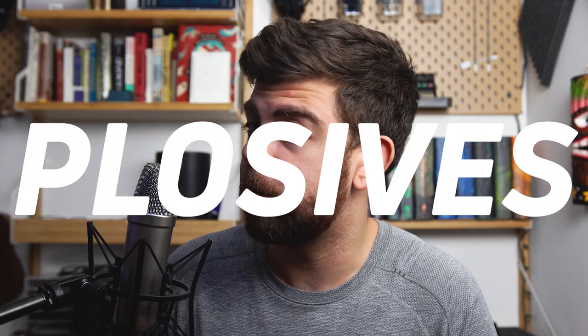Now let's get into where you should actually place the microphone. This depends on the type of mic you have, but if you have a cardioid mic like the Rode NT1A or the famous Blue Yeti USB mic, the one thing you should not do is speak directly into it — you're going to get a lot of plosives, those annoying P and T sounds. So move around the mic a bit and see what sounds best. Put the microphone about two to five inches away from the speaker's mouth, angled slightly off axis so the front is pointing slightly past the mouth. That way it's not picking up plosives, just the voice going forward.